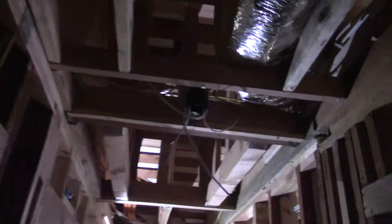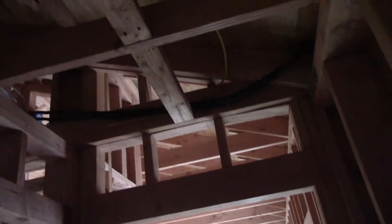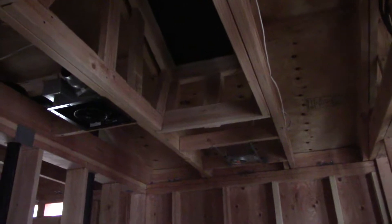In this room, the existing framing got reframed — an opening where a slider was pulled out and a window put in. You can see the cripple studs above the existing plates, a new rough sill, a double sill, and existing framing. This is going to be a drop ceiling, so this all gets drywall on the ceiling. This is all new framing in here — new headers, new skylight well framing. The way they headed off and framed this based on the skylight is pretty cool.